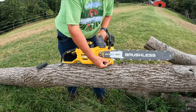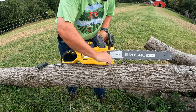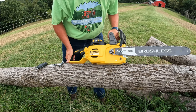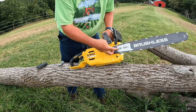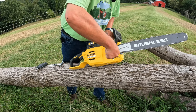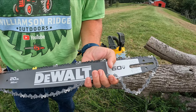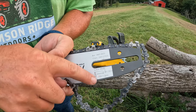The chain adjustment on this is a big knob right on the bottom, a lot beefier and bigger than what I've really seen on about any other saw. It's just typical adjustment — turn it left for loose and right for tight. Everything else inside is pretty much standard. You've got your metal studs and your chain adjustment sticking through the bar. The oiler is just a little tiny hole right there. Now that I've got the bar off, we can see the actual chain size: it is three-eighths low profile, 68 drive links, and it is a 50 thousandths chain.